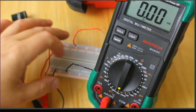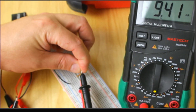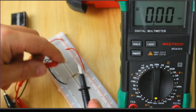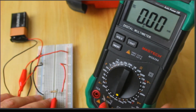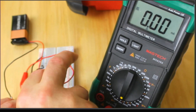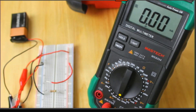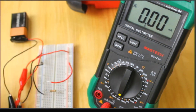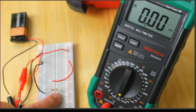You can probably predict what's going to happen, just like with the voltage measurement. I'm going to put my red lead on the side closer to the black terminal and my black lead on the side closer to the red terminal. There we go - negative 9.4 milliamps. So it's just going to put a negative sign in front if you have the leads reversed when measuring current. That basically walks us through how to make a simple current measurement with the ammeter, and hopefully this helps explain how to use the breadboard.